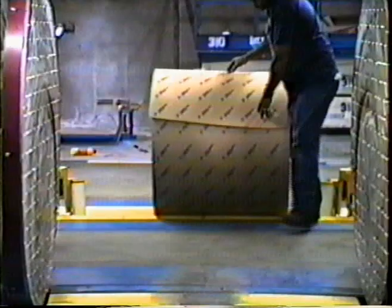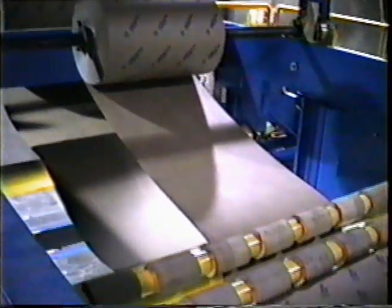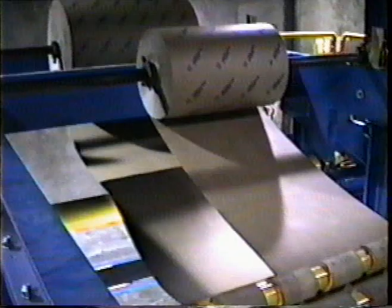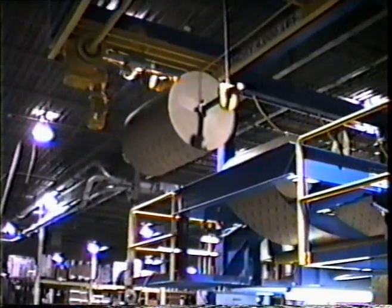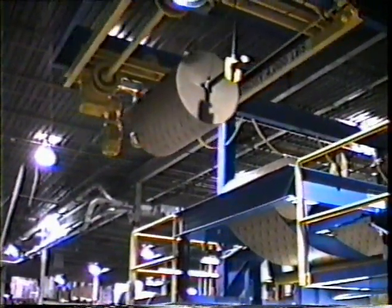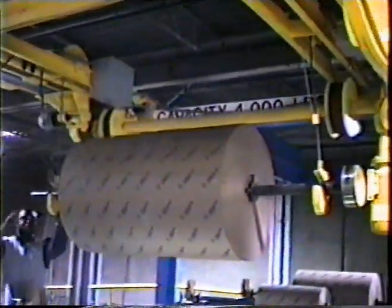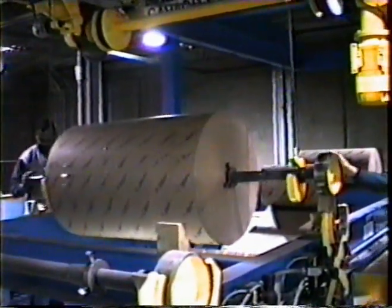Brinkley uses an overhead wrapper backstand which holds from four to six wrapper rolls of varying widths. This unit holds four rolls. Wrapper width can be selected automatically or, as in this case, manually. Wrapper rolls are chucked on through shafts and loaded onto the backstand with an integral overhead crane. Wrapper shafts have air operated brakes to prevent overrunning. Rubber coated wrapper feed rolls are electrically driven. With the proper wrapper width selected, an air clutch is engaged and a variable frequency drive controlled motor feeds the wrap. Wrapper drive speed is synchronized with turning roll speed.